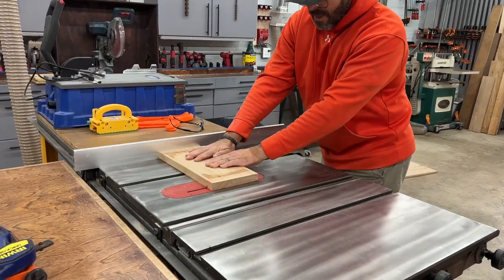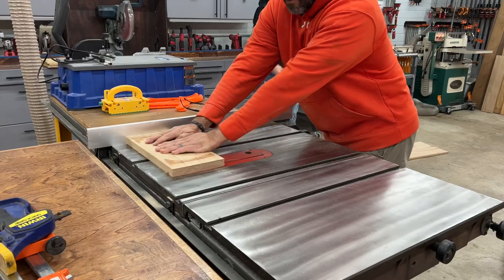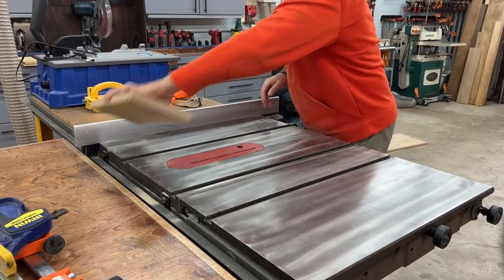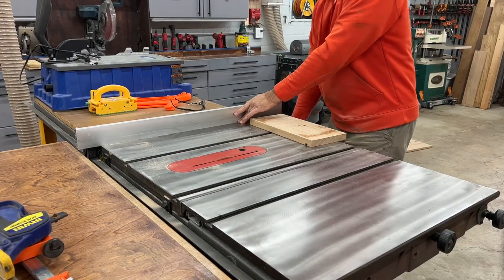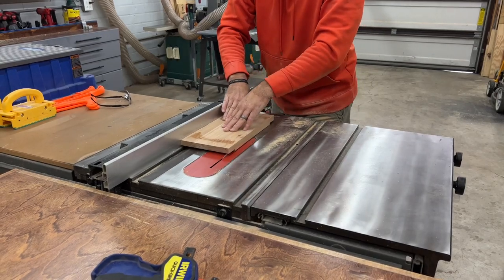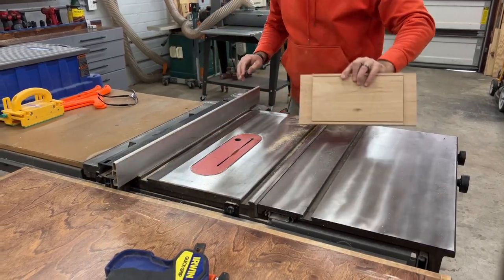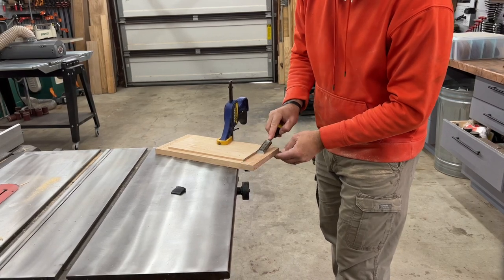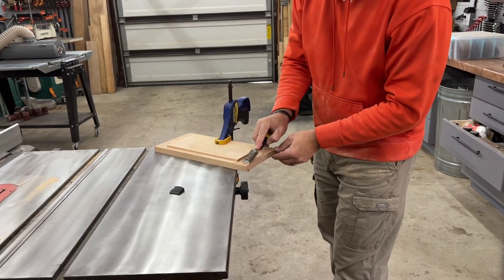I went with the hickory base for the display case. I hogged out material on the ends and the sides so the box fit over the raised panel with very little play. If I had this to do over again, I would do something similar to a juice groove on a cutting board. The acrylic box would sit right in place, protected by a channel cut out by a router bit. But the solution I chose still works very well.